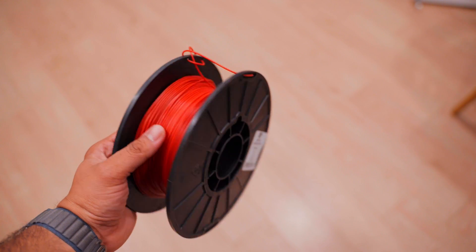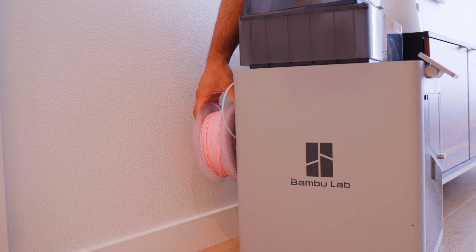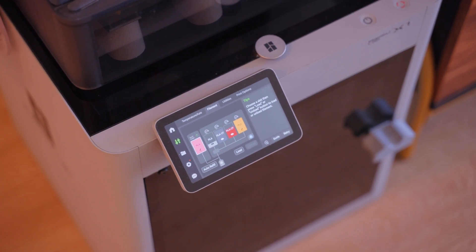There are some materials that you just can't put in the AMS — like TPU is too soft and the carbon fiber blends are too brittle — so I really like using the normal spool holder for this kind of stuff just to avoid any jamming in the AMS, since it is kind of a pain to get apart and clear out. There's even an option in software to have a fifth spool of filament loaded on the spool holder outside of the AMS.